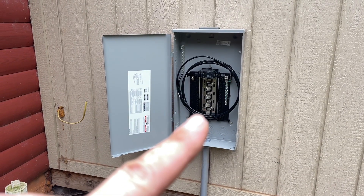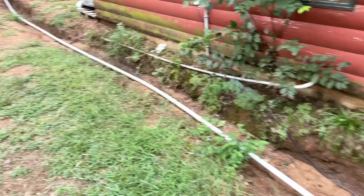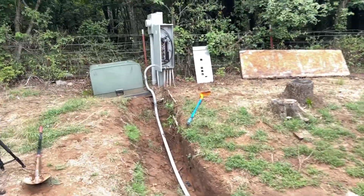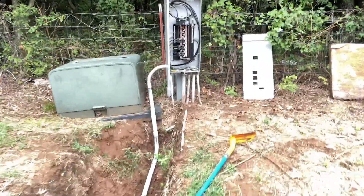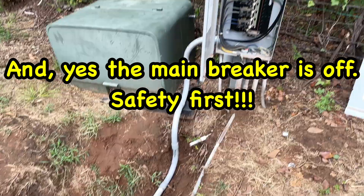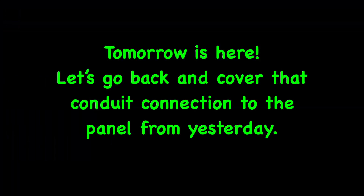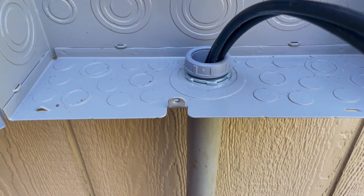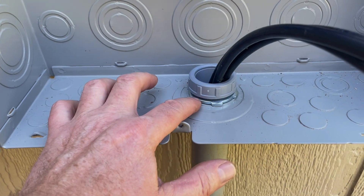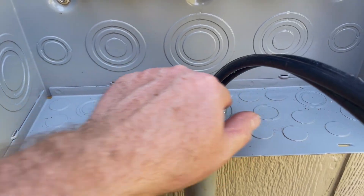The panel is installed, all the wire is lined up, and we're going to make it weather-tight because it looks like it's going to be raining soon. Everything is glued. We got it pulled in here, and I'd do a little dirt work to make the conduit lay down a bit better. Always remember to put the nut on and then put this cap on — the nut will lock it in so it doesn't come out, and that's just a protective thing for the cabling.